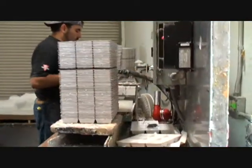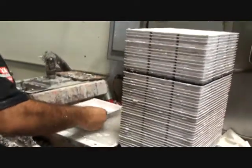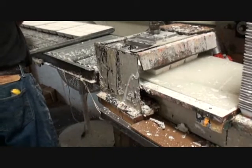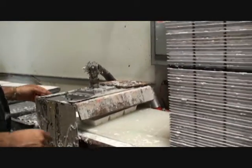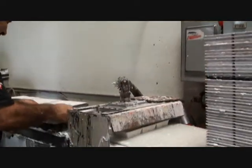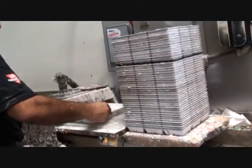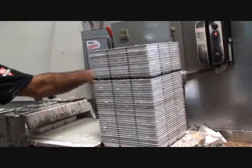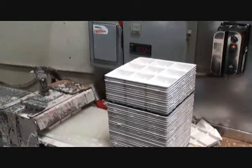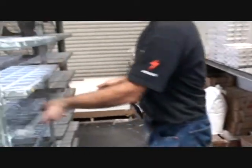So wax is mixed into different drums depending on the formula. Then there's a filling machine — the filling machine itself is custom made for us. Basically every five seconds we produce nine bars of surf wax. So one man and one shift can do about 18,000 bars in a day. With two people, in about seven hours we can do 24,000 bars.